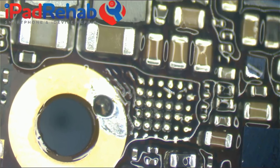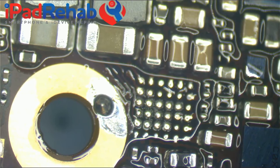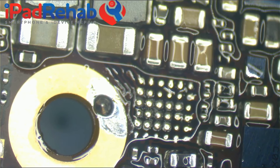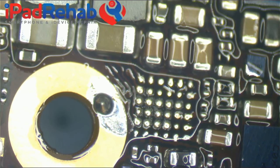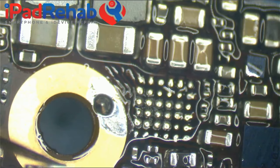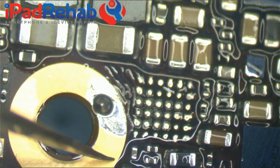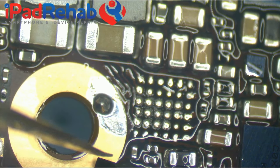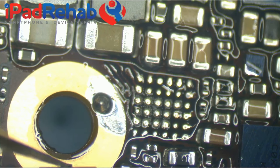Do you prefer 6040 or 6337 for microsoldering, or does it not make a lot of difference? It probably doesn't make a lot of difference. However, if I had to pick, I'd pick 6337. That's the eutectic solder, which has the magical property of having a very, very narrow plastic range. What that means is that it is going to be totally liquid at 185 degrees or whatever it is, something close to that, and totally solid at 184 degrees or whatever the actual number is, something close to that.